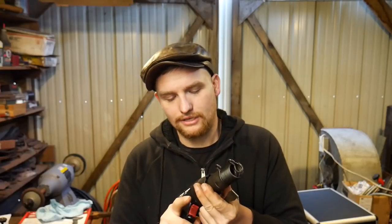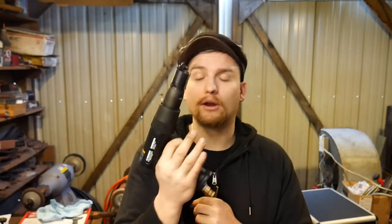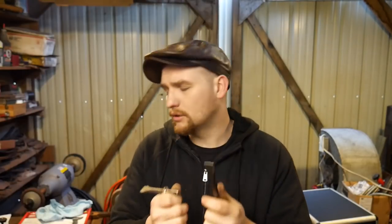We're essentially going to do that but make something that works with this air tool right here. Wait till you see it — it's going to make quick work of rivets. If you want to Google air riveting or pneumatic riveting you can see how it makes quick work of joining pieces together. I'm going to show how to make some of that tooling — a fairly simple set, though you can get as complex as you like — and over the next couple of videos how we can modify these tools for chasing and repoussé work in copper, steel, brass, or whatever medium you prefer.